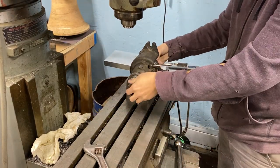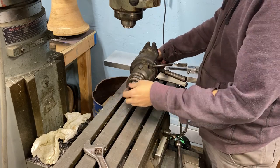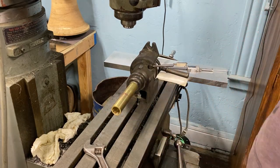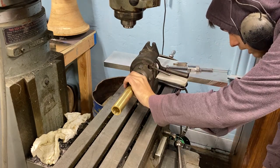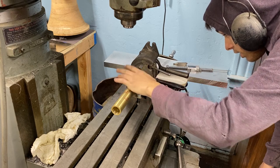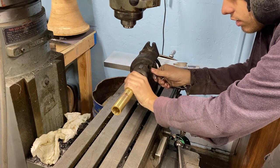You don't need to get super tight, because we're going to be bumping it around a little bit to try to get to center. Get this collet out of here, grab a one-inch collet, see if we get our thing chucked up in there. You've got to find where the key goes and kind of convince it to go in. There we go — we've got rotation. So we are going to start at zero. Everything's based off of our connector. That's going to be pretty dang rigid. To go 120 from there — that's 90, that's 120, which lines up with that thing. And then another 120. And then we go back to four — that's our 180. Let me make sure it actually slots in all those positions because these have alignment pins. Slots in zero, slots in 120 — this is like the luckiest day of my life. Usually never goes like that.